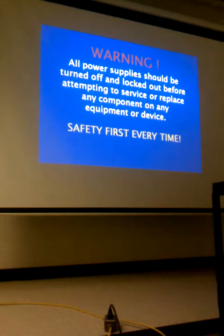They weren't sure whether the shock killed him or the impaling. If you don't have appropriate lockouts, at minimum turn the breaker off, put your card over it, tape it closed and explain why it's off and that you're working on it. Take the disconnect out. Tape the breaker panel closed. Go up and take the leads off the unit. When putting them back on, verify there's no power — check each wire to ground before reconnecting. Make sure power is completely off before you electrically unwire or rewire.